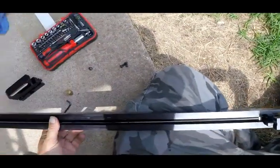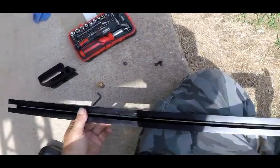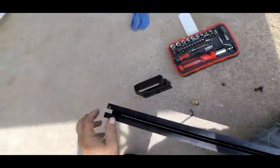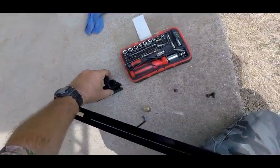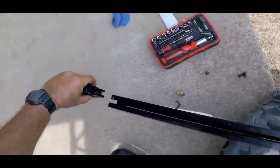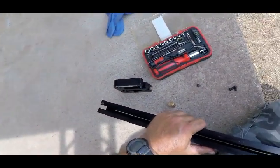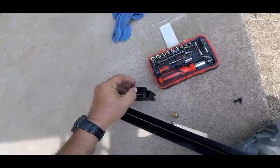It's not hard to take apart, and I do recommend probably once a year it would be a good idea to take one of these apart. Now, you've got this stop screw out here — you'll take it out. What that does is it keeps this from going out the end when you're using the press. So this is the screw here, it goes in this.